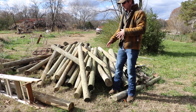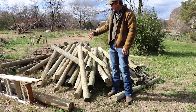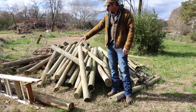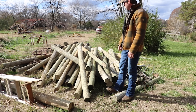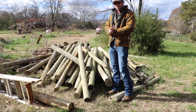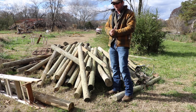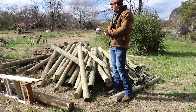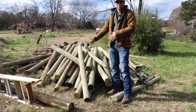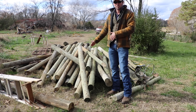I think the posts you could get at a place like Tractor Supply are probably similar to these. In fact, some of these could be Tractor Supply posts — I bought these at auction, so I'm not sure where all of them came from. I just know certain ones because they still have the General Timber tag on them. I like the treatment process our local mill uses and I like buying local. I know I can trust the product I'm buying there. So if I've done anything wrong with posts, it starts with the material I've used in the past. Treatment is extremely important when it comes to posts — they're going into the ground.